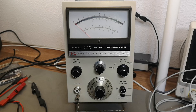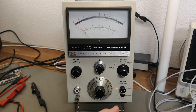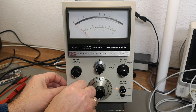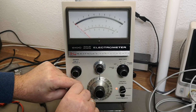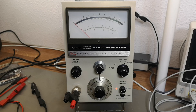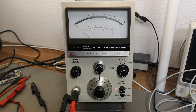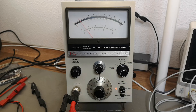Let's try the first power-on. Mains is applied, nothing bad happened. We've got a lamp and five watts of power usage. The input connector is a PL-259, so I need to add my little adapter. I've got 100 millivolts coming in here, and we see nothing - oh, it's because I'm in meter off. Let me try meter positive.